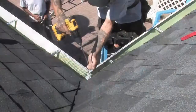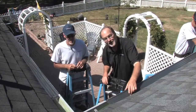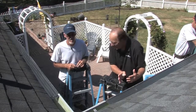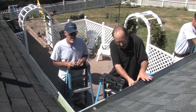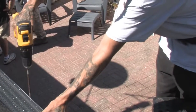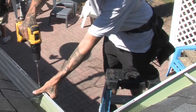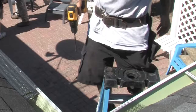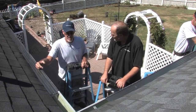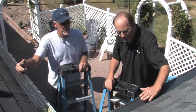It's still screwed in. When we use the gutter rx product, the way it screws in actually draws the trough up and adds more integrity and strength. We use inch-and-a-half stainless steel screws through the back of the rx, which penetrates the back of the gutter into the fascia board itself — the same screw we use in our hidden hangers. It is in fact an extra layer of rigidity and stiffness.